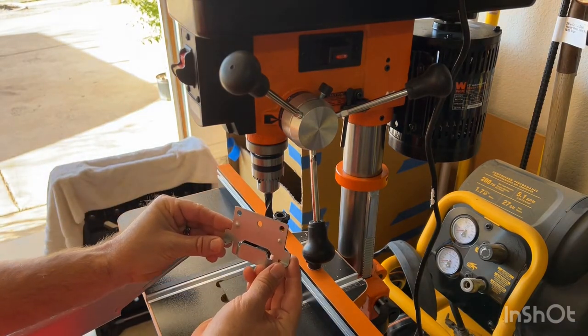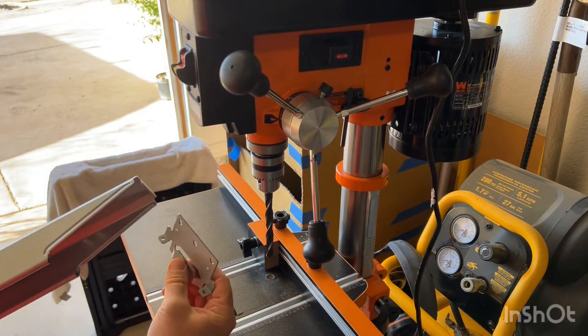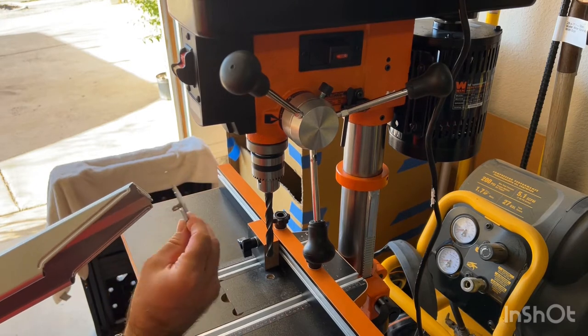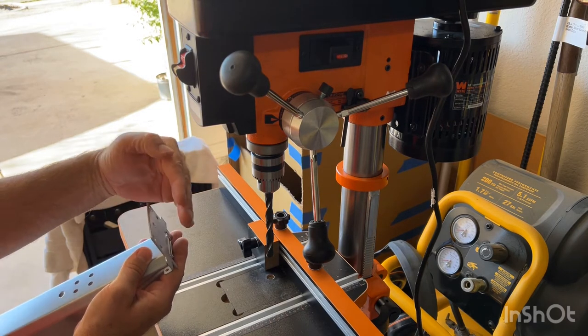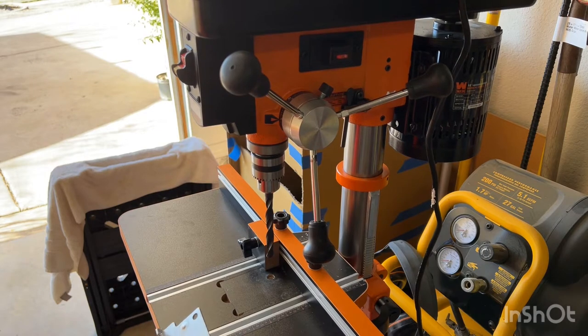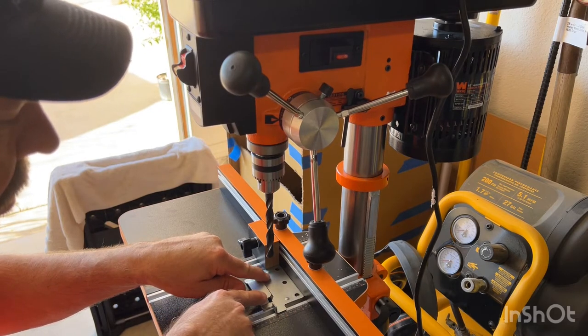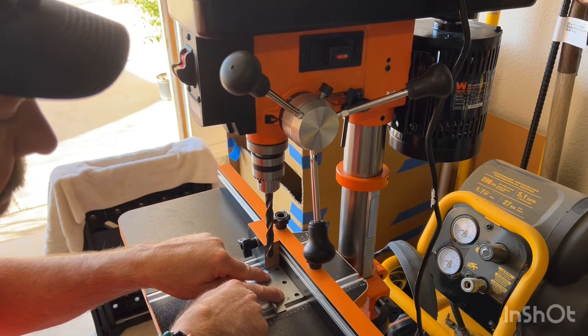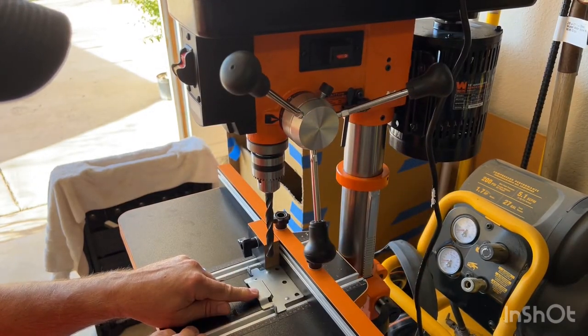So here are the Svorka brackets, and I've got one of the platforms right here — they fit precisely in that lip, right in there like that. This forms the basis for the bracket that hangs to the L-Track. The important piece we're handling right now is we need to drill out two holes, two inches apart — one hole here and one hole here — that'll go into the bracket I showed you earlier. It's really important to have a drill press for this exercise.